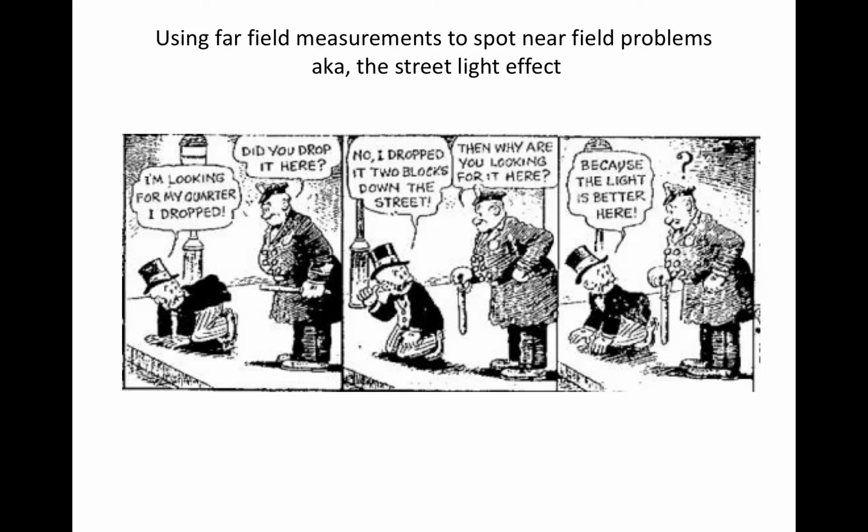But one thing that comes up a lot that's different than what we talked about is that people who work in the CISPR 22 world, and actually CISPR 22 I think is obsolete, but I can't remember the name of the spec that replaced it. What I'm talking about there is the people who make measurements at 3, 5, 10, even 30 meters, right? Basically it's far field work. They'll quibble and come up with corrections, and I call those people the tenth of a dB people, because they get worried over stuff that we just don't even think about. But a lot of times those people will look at 1 meter measurements and say, our repeatability or our uncertainty is so much better than yours, and you should do things our way.